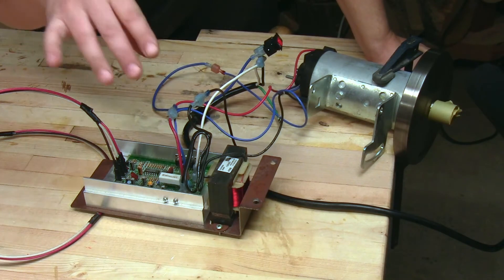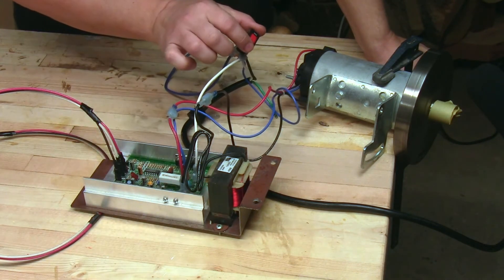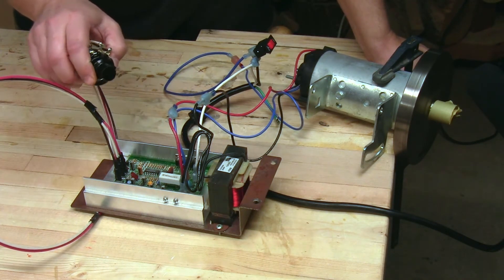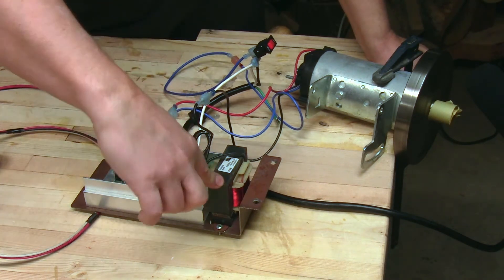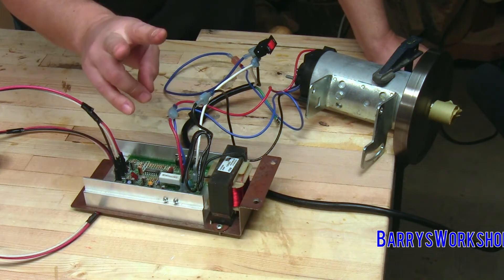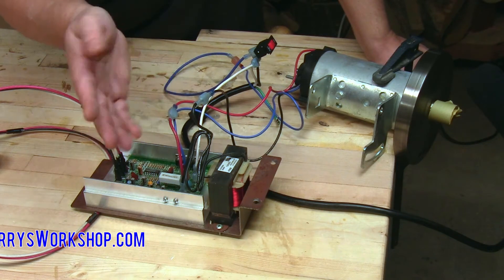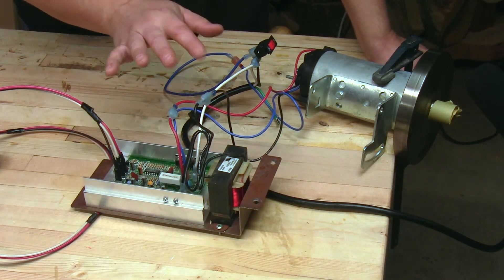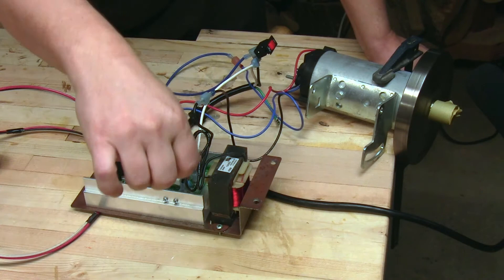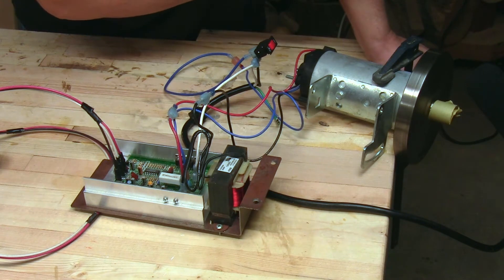Here's the setup that I had at the end of my conversion video. I've got the speed controller with the coil in the circuit. This is the power switch, then the motor, and I've got my 10k potentiometer that I'm using to adjust the speed. The question is about this component here. This is a coil or an inductor — it has two wires going through it. If it was a transformer it would have at least four wires, more than two pairs. Because it has two wires, I know it's an inductor, or a choke, sometimes called a coil — those are all three names for the same thing. In theory it should smooth out the operation of the motor, but let's run some tests and see if that's actually true.